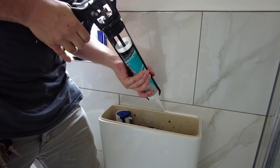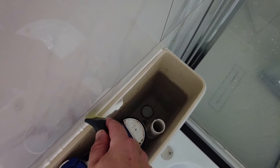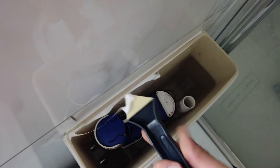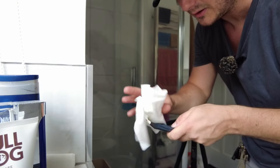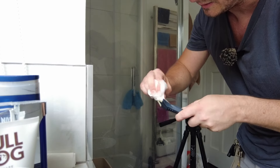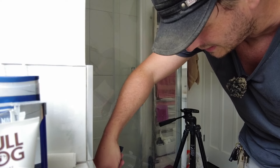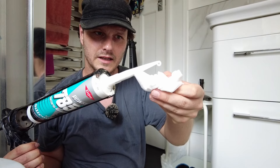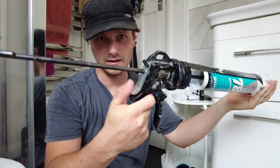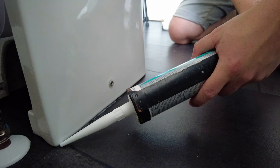This bit isn't as critical because no one's going to see it, but we want a nice amount down because we want it to actually stick to the wall. You don't need to put big blobs down the back of the cistern — this is enough to stick it. Scrape it like that. Get yourself loads of tissue — that's what you're going to use to remove the rest. Do not use washing-up liquid; there's a video in the corner explaining why you shouldn't do that. Every time you use your silicone gun and you let go, it's going to carry on coming out — just click and push it to release the pressure.